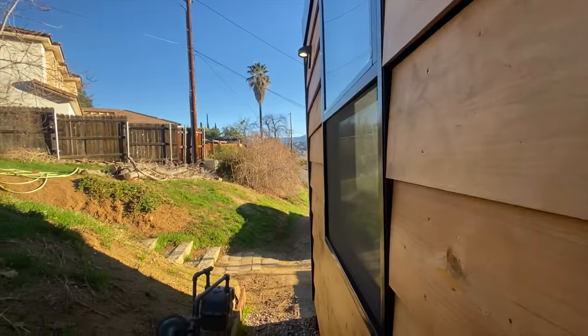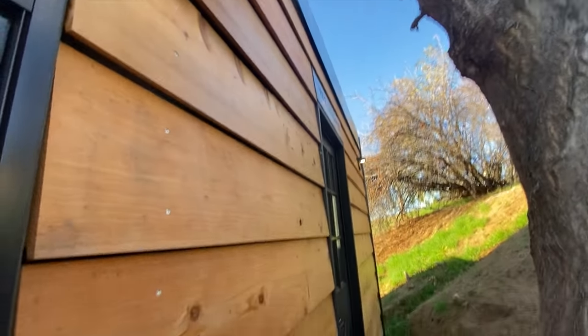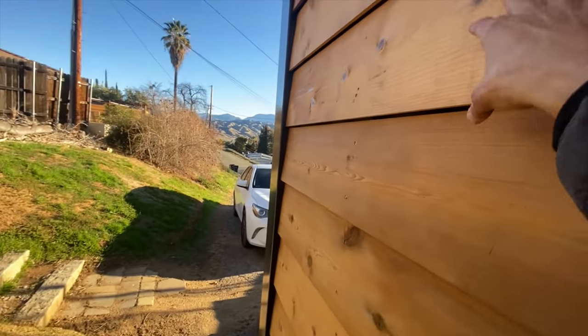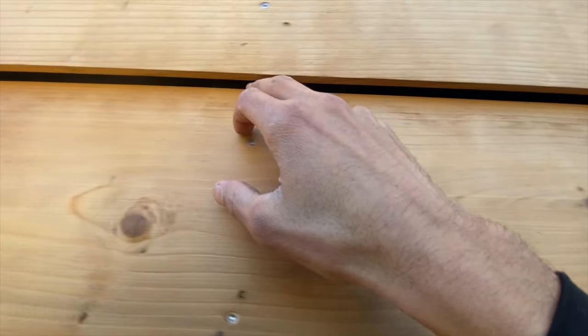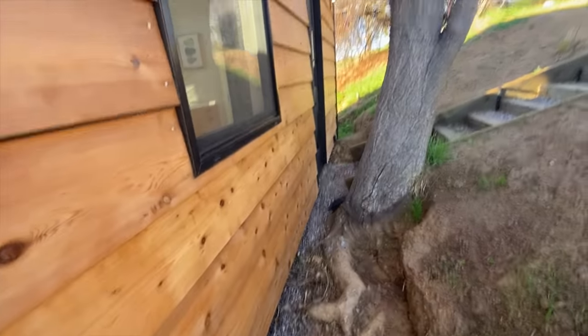this is a cedar 1x8 siding. And it's open joint siding. So this allows for ventilation of the container. Wind can get in there, and the container itself is completely waterproof on its own. So the cladding, the siding, also shades the container, but I like this because you can do easy inspections here, and you can just easily service the house. You can unscrew these fasteners right here to take off siding and replace them or inspect them.